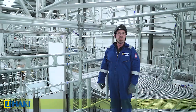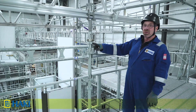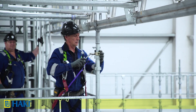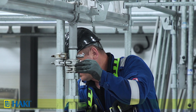Once we preset the erection braces, we bring them up to where we're going to start erection of our suspended scaffold. First, three sets of pockets above the platform level — 1.5 — we set a check fitting, then onto this we put the swivel of the erection brace above it, and we repeat the same on the opposite side, making sure that the hooks are facing inwards.